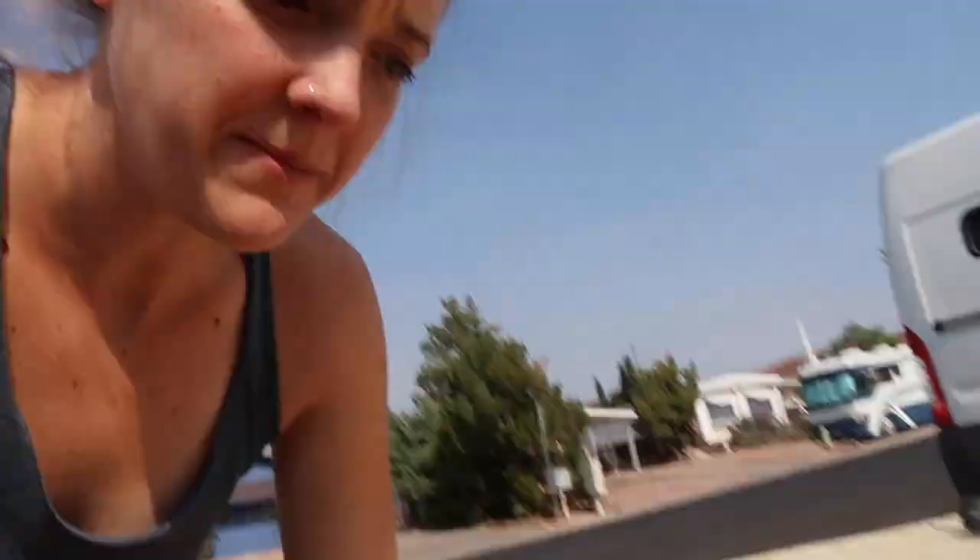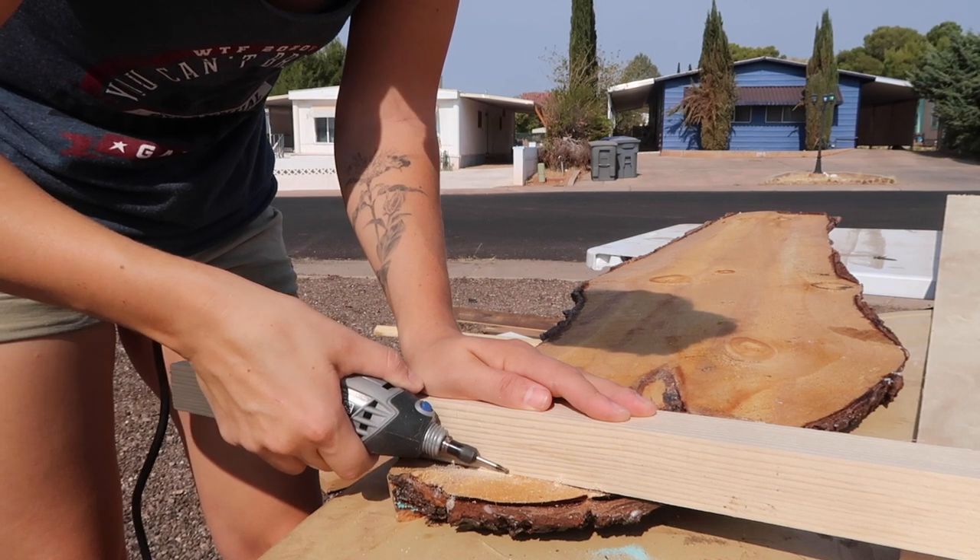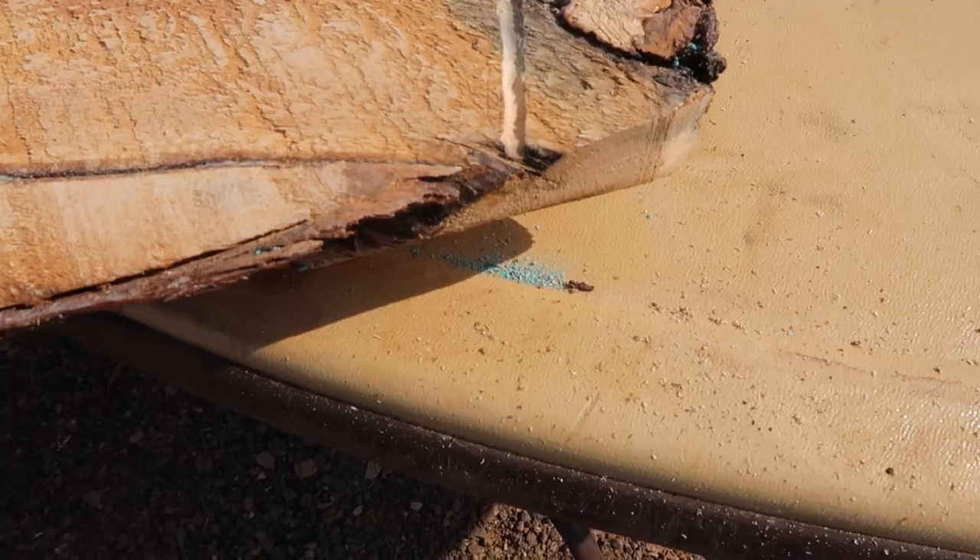Right now this is the back of it and the front is dry, there's just a little bit of wetness in parts of the bark. While that dries, I'm going to make some grooves in the back with my Dremel, using this little tip. I have my two grooves done. The rest of the table I did the exact same steps as I did for the top — once I cut those grooves in the bottom, I just sanded everything smooth, covered it with a few layers of that water-based polyurethane, and that was it. The table was done.